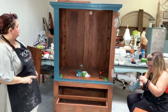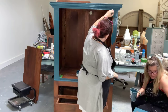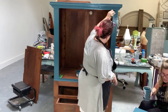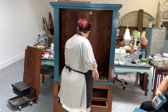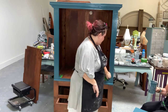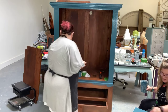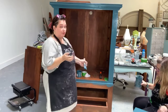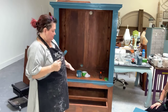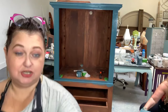I love this color. All right. That paint goes on so nicely. Well, and I've been taking Melissa's cross-hatching advice, because it does give nice coverage too. It's a quick, nice first coat coverage. Yeah, you don't get streaks. Exactly. There is some streaking technically because you're adding it, but it doesn't come out looking like streaks when you're done. Your second coat just kind of textures. It gets rid of what is normally the problem, that you end up with lines and you feel like you have to do a third coat because of the lines, but the cross hatching kind of eliminates that feeling. Right. Let's see, I'm gonna move the camera down because we're going down to the bottom section.